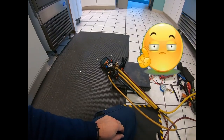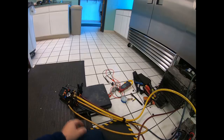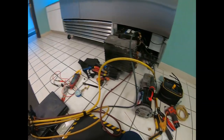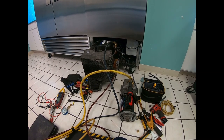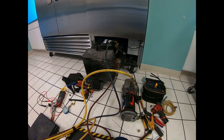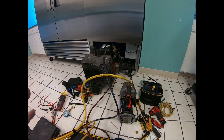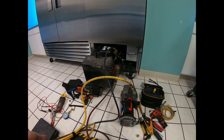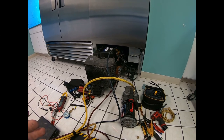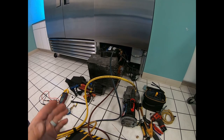Either way, I wanted to remove that tap — I'm not a fan of those at all. Yes, I'm doing it the slow way, but it's a small system. We're going to pull this thing down and recharge it. That way we can eliminate possibly any contaminants in the refrigerant or any mixture of something else. I want to spend a little time to make certain it's not something I can prevent them from spending money on a new compressor. I want to be 100% certain before I push them down that road.